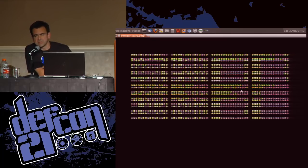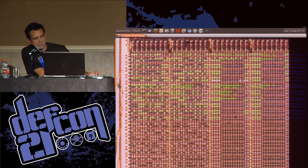We also want to try and make sense of the data. So in this particular case, we knew that an unused piece of ROM has a hex value of C1. So if I come out of peephole mode and we look back at the original image, there are these big chunks of unused data here. Okay, so here's obviously program, and here is nothing. And this repeating pattern, therefore, we would say must be C1s. So what we should see here, because it's 16 bits, I'm hoping is C1, C1. Now, the quick amongst you will have noticed I ain't going to get that.